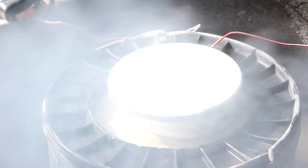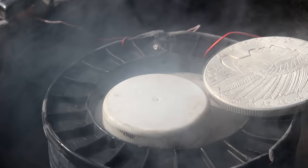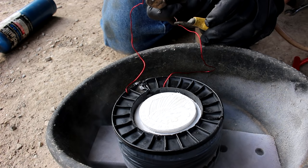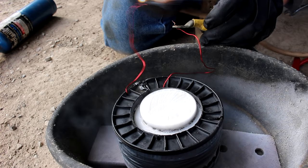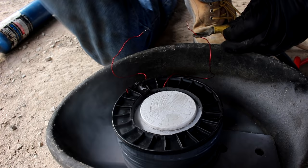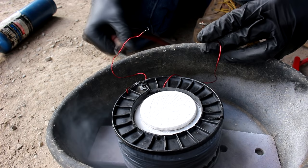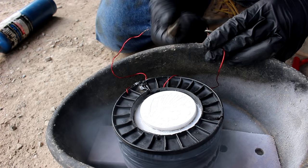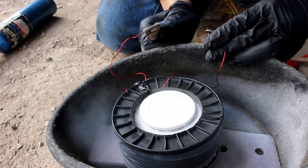Let's try putting a little gap here so it's not quite so close to the magnet. That's interesting — I discovered a little something. If I hook it up like this so that the wire can move, the magnetic force causes the wire to deflect and get pulled off of the contact, and then it comes back because there's an elasticity to the wire. So I made a bell!